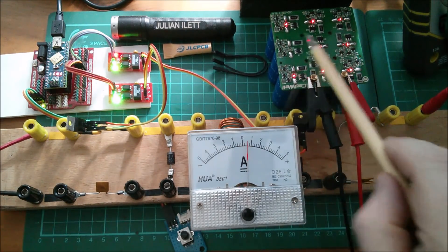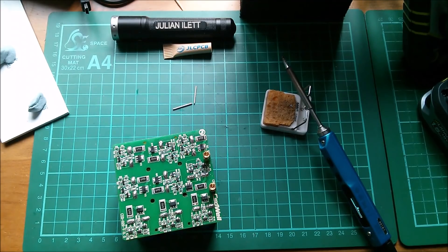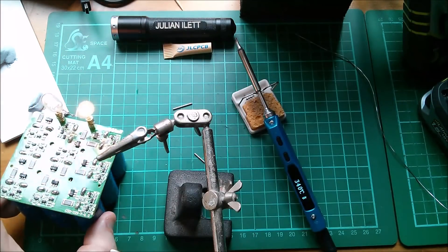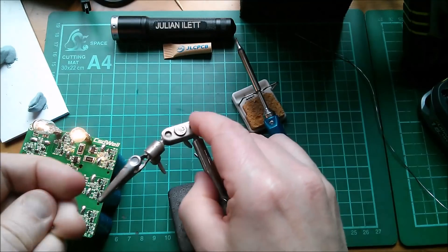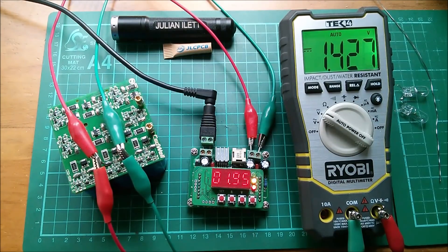Another tidy up and let's get that wired up. I'll use diode off-cuts - I kept all the diode off-cuts from those big fat diodes because they make very good thick connections - and I'm going to solder them onto the lazy capacitor. I've got to remember these caps are all charged up, so I'll stick my bulbs on there and gradually discharge that all back down again - be a lot safer if I do that. This is the setup to charge the rogue capacitor. I've soldered a couple of thick wires onto it.